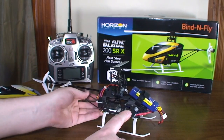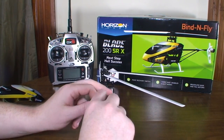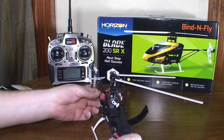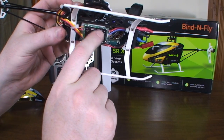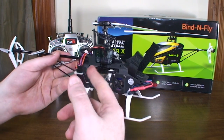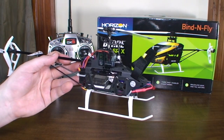Always make sure to position the battery with clearance from the servo. There's velcro on the helicopter and battery, plus a velcro strap to secure it. The battery takes about an hour to charge at the standard 1C rate. The manual says to set a timer for eight-minute flights, but I've gotten mine to fly as long as sixteen minutes without hitting LVC. LVC shows as a blinking red light on the control board.